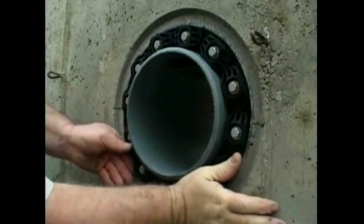The belt is positioned in the annular space between the pipe and wall. Some angular misalignment and eccentricity may be allowed by using Link Seal. Pipes that are slightly off-center, or installations where some axial misalignment exists between pipe and wall, are sealed even though they are not perfectly centered.